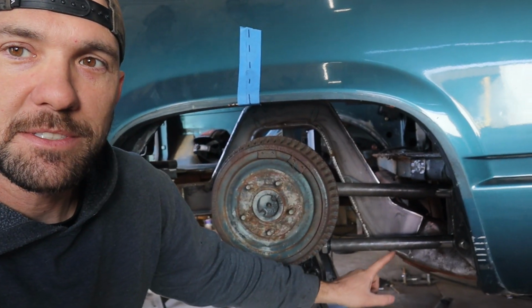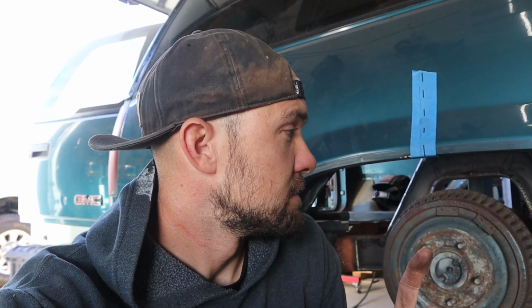I got the brackets welded on. I got the bars parallel to the ground at half travel. Instant center hits the front bumper through my calculations. And I think it's gonna work out. The downside is now I gotta do the other side. So I gotta cut some of the stuff back off, which is why you always tack stuff on before you final weld. That way, you know, everything works out. I've said that before. Tack stuff on, make sure it moves, then you can fully weld it when you're 100% happy with everything. And I'm pretty happy with this. Now we gotta jump to the other side and do that, and then we'll jump to the Watts link, which should be fun. So keep going. Just remember, not everything always works out, and you just gotta keep on going.